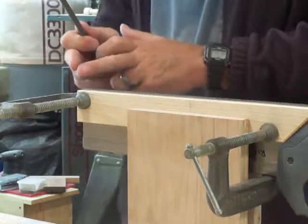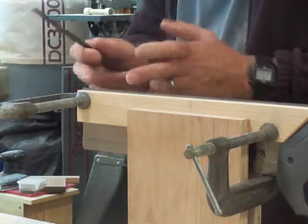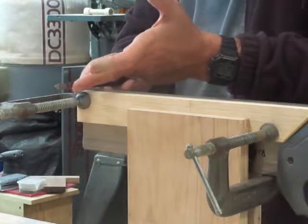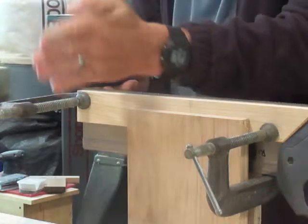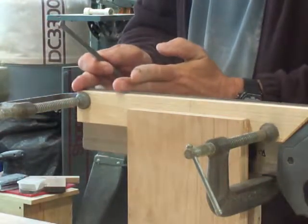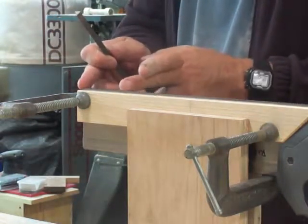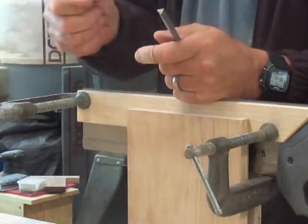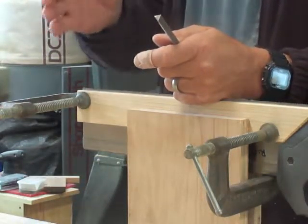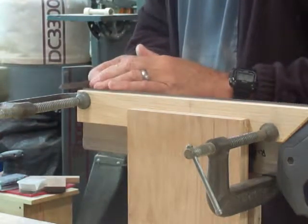And then I like going from the nose of the saw to the heel, and I do the first few teeth with it. This face is not plumb up and down, it's leaning back a little. I'll do the first few inches with that little bit of lean. That way I do have starter teeth if I want to use them. They have almost a negative rake angle. They certainly aren't aggressive, and they make the saw easy to start when you're cutting.